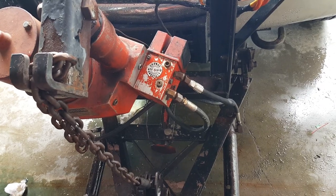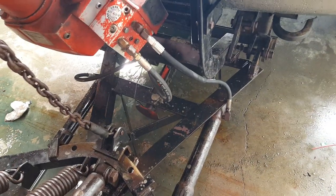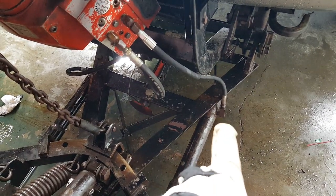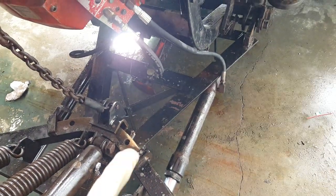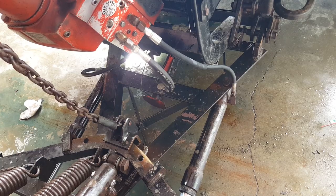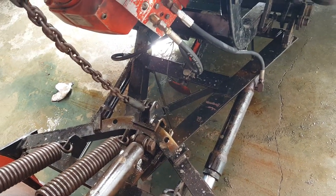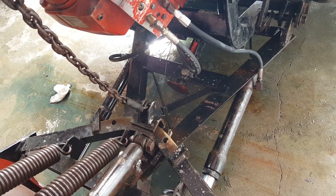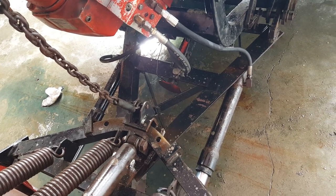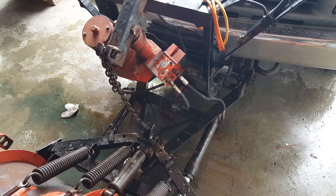What you actually do — and I'll write this in the video link as well as a step-by-step process — is if you can remove that piece, then you push this all the way in, and then on the other side of the valve, make sure you put your thumb over it or get a good seal on it so you don't suck air in. Then you push it the other way, and that will push the air out of the system as long as you make sure you're not drawing the air back into it when you do that. It did work, and now we're back in business.